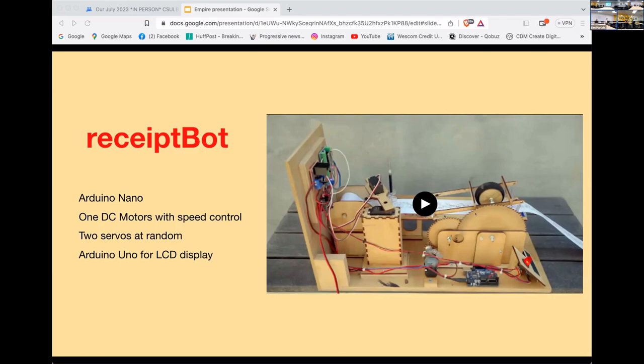And then there's also a program for gears. You just put in how many teeth you want, whether you want spokes, all the parameters, and it'll spit out a file for the gears. And then the other stuff, like maybe all this square stuff, I designed myself in Inkscape and then cut it out. But yeah, the laser cutter is awesome for making parts. I kind of like it better than 3D printers, which take forever to print anything.